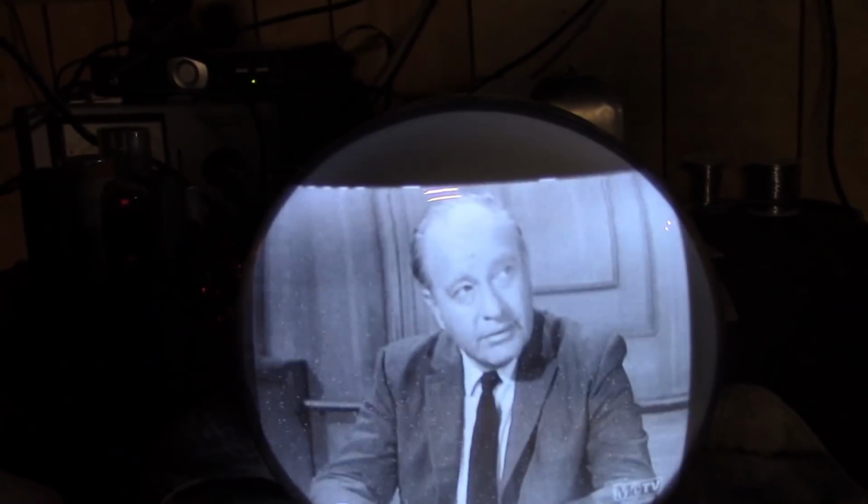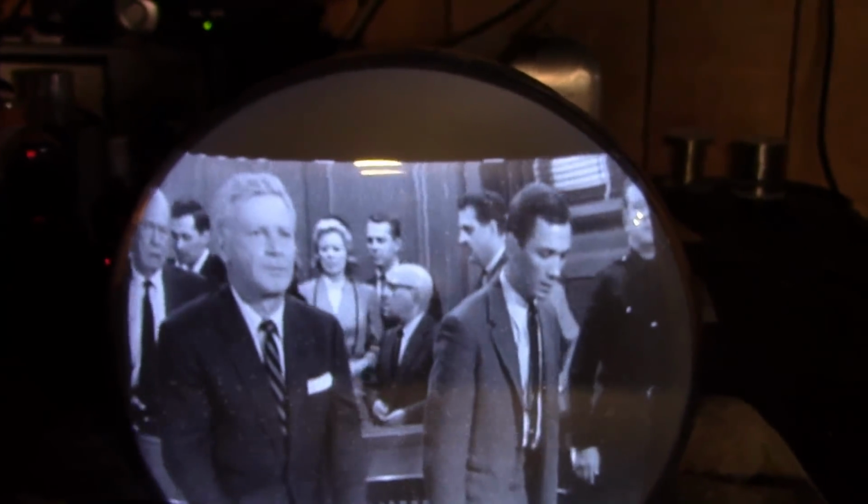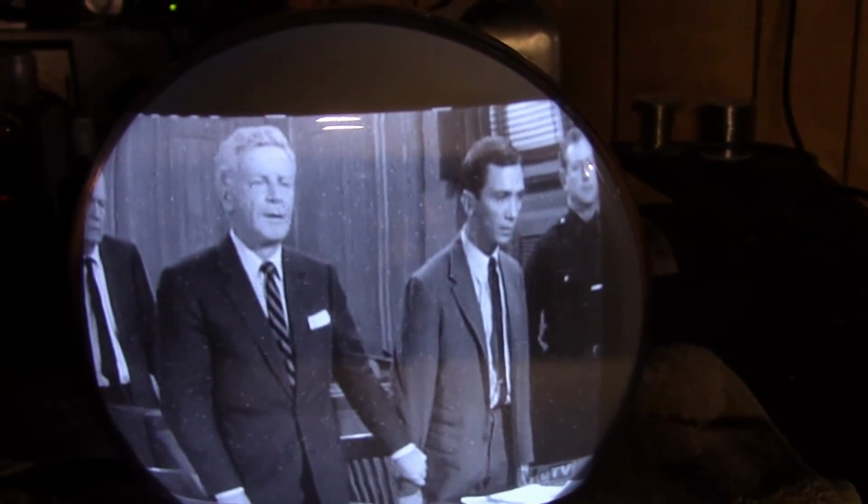It becomes most visible when I turn the contrast all the way up. I back it off and turn the brightness down, and that's still pretty noticeable. Now, I'd already gone and grounded the grid of the video amp, and that interference does disappear. So, one easy possibility is there is this metallic shield in the CRT, which should be grounded right now. It's not going to anything.